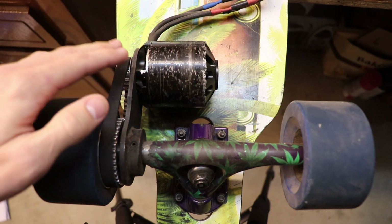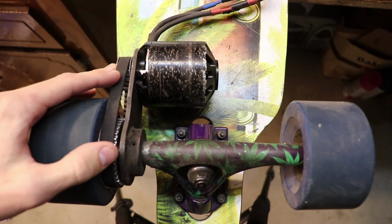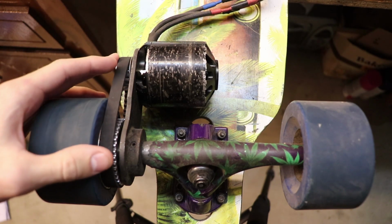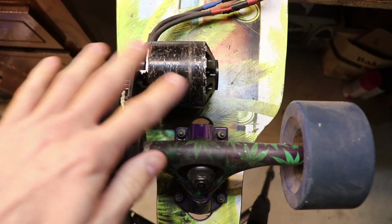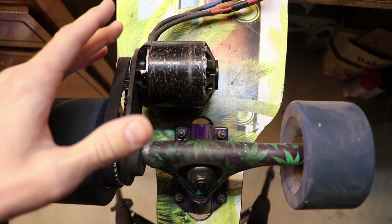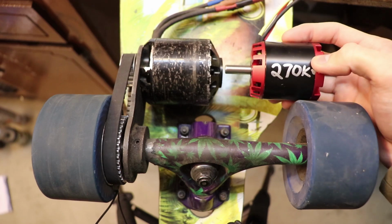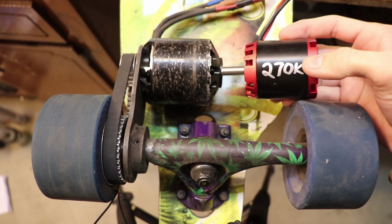And if you're going for a one motor setup, then you only have to buy one speed controller for the motor. But if you're going for 2 motors, you're going to have to buy maybe more batteries and definitely more than one speed controller to control the motors, unless you buy one speed controller for both motors that's beefy enough to handle all the power that the motors will require. So if you're going for a 2 motor setup, go for a higher rated kV motor, which will be smaller and provide less torque, but it will be easier to mount to your wheels.